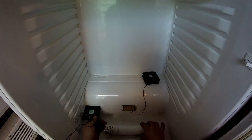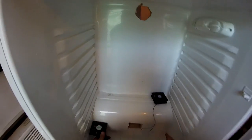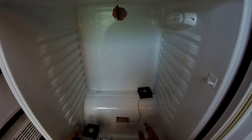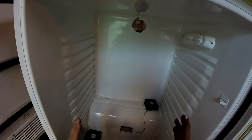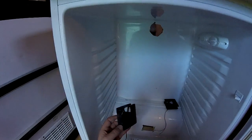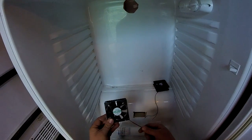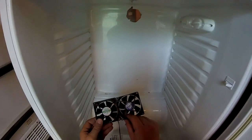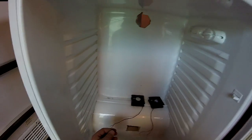We're going to get good recirculation of air across whatever we're drying, a nice source of heat, and the fan will pull moisture out up top. As soon as you reach temperature the STC turns the heater off; as soon as it drops it turns it back on — with about a 5-degree centigrade threshold. There's no cooling in this, and we'll be drying at around 60 degrees for the jerky. To power the fans I've got a 240-to-12-volt transformer — only 4 amps, which is plenty since the fans draw 0.12 and 0.19 amps.